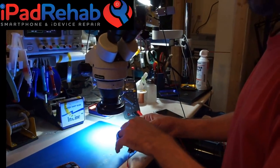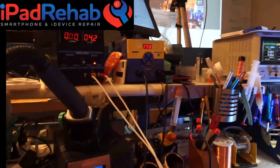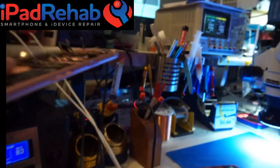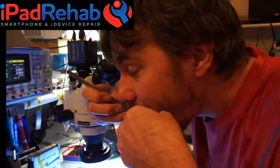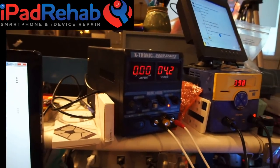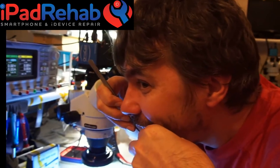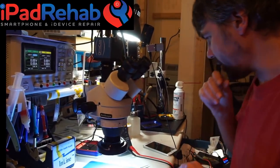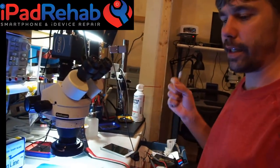I'm not picking up anything with the fingers on the top of the board. The 1V8 SDRAM line — the place I know to check it is under this sticker. I don't have all the lines memorized on the 7 but 1V8 is the one by audio. It's this guy — three in a row, the one close to the bracket. 1V8 SDRAM — boom, another vote for experience: 0.004 away from short.